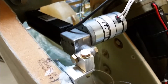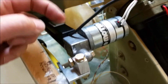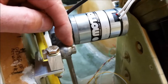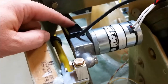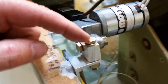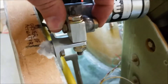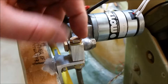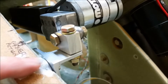I'm going to do some cleanup actions. Right now I'm showing you the actuator motor — you can see this mounting bracket right here. I may not have explained that well enough last time. With the way this bracket is here, this mounting tab — this whole assembly can go up and down, but it doesn't need to go up and down; it needs to go left and right. Therefore I made this bracket that swivels, attached via this quarter-inch bolt. This is not the final quarter-inch bolt. So this swivel bracket then attaches to the main bracket.